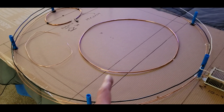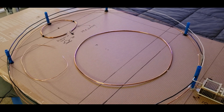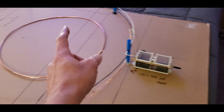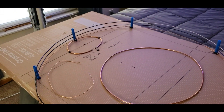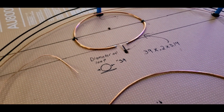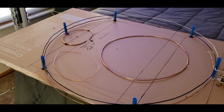The loop diameter is just for resonance on whatever frequency you want. The capacitor is what really places you in the band. Your antenna diameter is for resonance only. As long as you have your formula correct for your outer coupler loop, it's going to resonate somewhere.